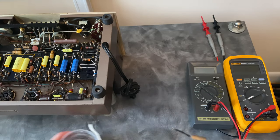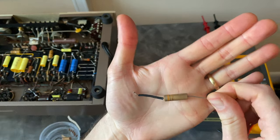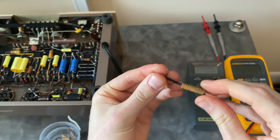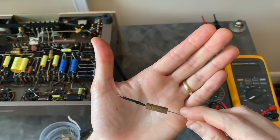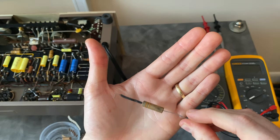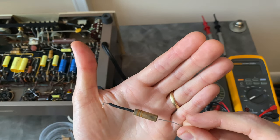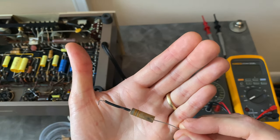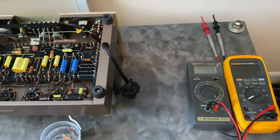So in the amplifier that was less modified, it had the original plate chokes in it. This is just an inductor. It's rated at 3.3 microhenry with a resting DC resistance of 0.33 ohms. As far as I know, this is just used to prevent parasitic oscillation in these parallel output circuits.